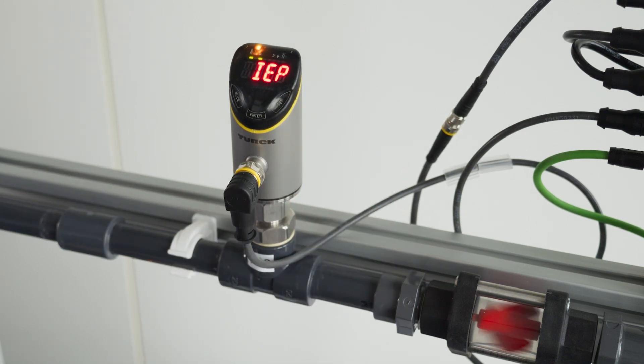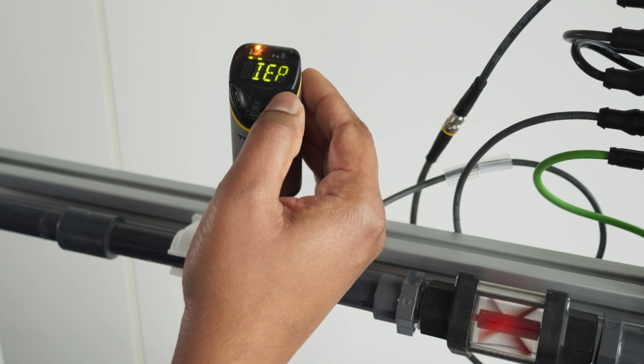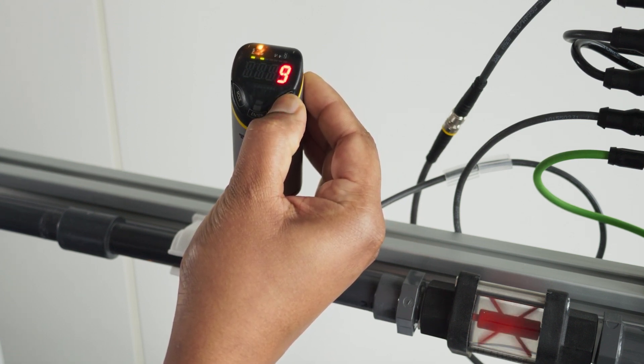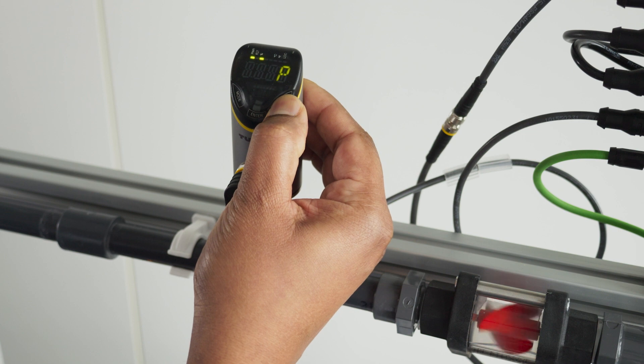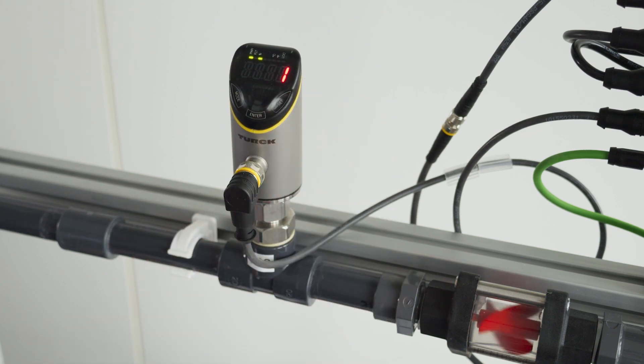I have to wait until it starts blinking green again to be able to save the value on the sensor. Now I'm going to save this flow rate as the maximum value by keeping set pressed. Between maximum and minimum values, there must be a minimum difference. This can be visualized again with the smart feature showing the values down from nine to one. I have to turn the valve down until at least this minimum flow difference is achieved, to be able to see ISP — indicated start point — on the display. When saving the minimum value of ISP, the delta flow monitoring is active. After the flow is steady, keep set pressed again to define the new minimum value. The sensor is now showing the relative flow between the newly defined maximum and minimum values.